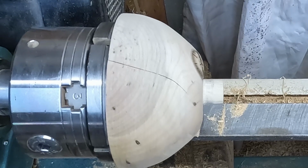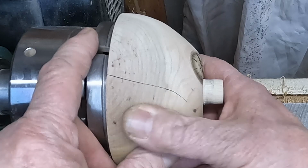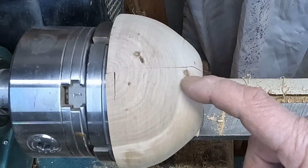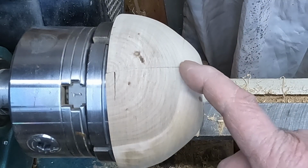So there was a lot of cracking, some breakage, and lots of repairs. Each base had to be reshaped, each mortise had to be less than 5/32 of an inch deep, and all the cracks and voids needed to be filled and then of course sanded again. Then it was time to laser engrave the bases.